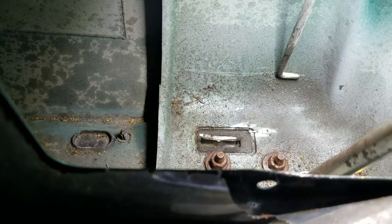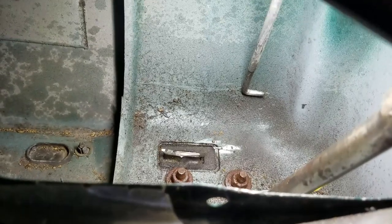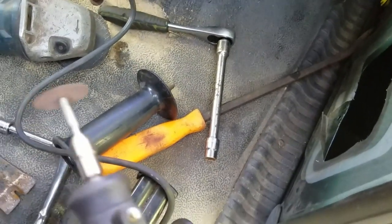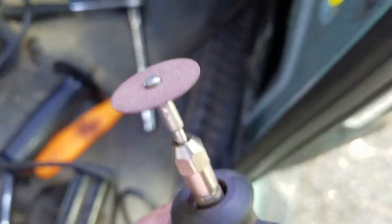With the angle grinder I had a smaller cut-off wheel and couldn't quite get as much cut off as I wanted. I still got about an inch and a half on the arm and can't get back to get at the bolts. So I ran the bolts all the way down and tried to tighten them until they snap off — that didn't work. I'll have to get a Dremel in there with a cut-off wheel. When you use this, go very gently because it will not hog material like the angle grinder and you'll end up breaking the wheels. I already broke two of them — it took three cut-off wheels to get this all done.